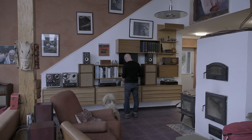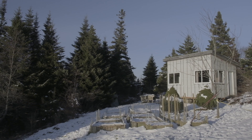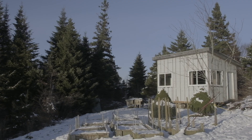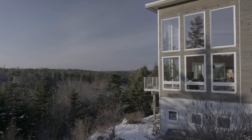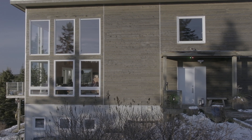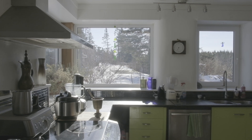I'm a geophysical technologist, digital cartographer, graphic designer — and I'm not a builder. The only thing I'd built before this house was a wood surfboard, and I'd helped my brother with his straw bale house. My first real construction experience was the little bunkie out back. I learned from books — traditional stick frame building, some straw bale books, lots of downloadable PDFs. When you're building straw bale you have to make some stuff up as you go. I trust physics more than chemistry. I'm not using a lot of caulking and silicone to keep water out of the walls — I don't think it works over time. Freeze-thaw cycles just crack it. I always build with the idea: if water comes in, give it somewhere to go. That's the whole basis of rain screen anyway.